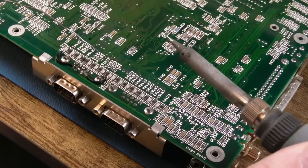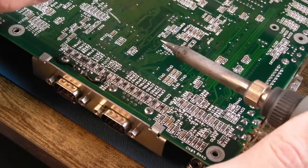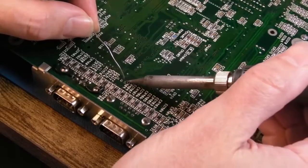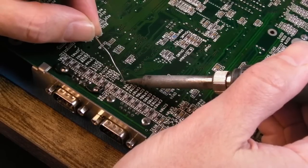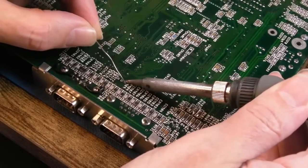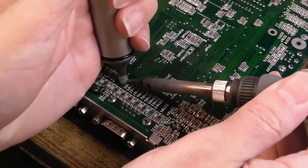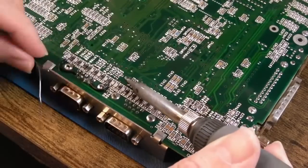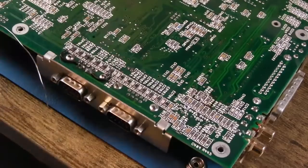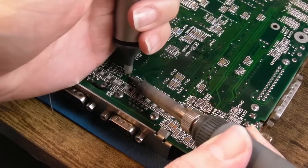The hardest one is the 10-pin one, or 12-pin, is it, the option jumpers that Commodore never used, but put in place, I think, assuming at some point you might have had a chipset on here that would allow 8 meg of chip RAM. So I'm just going to use the solder pump to do this. And obviously we need to tidy up the joystick port stuff here as well, so perhaps do that after I've sorted all these jumpers and things out.